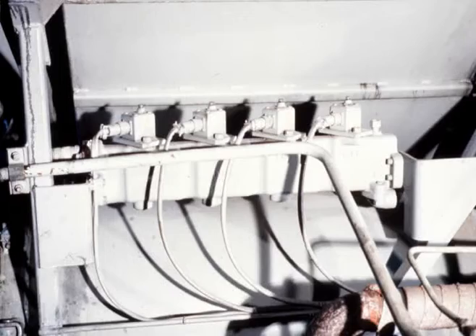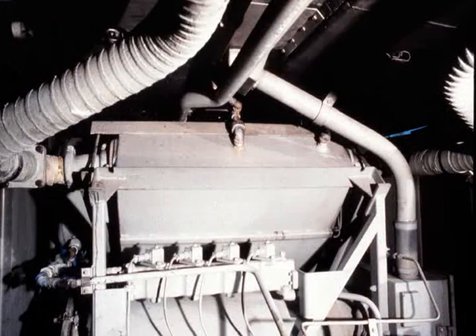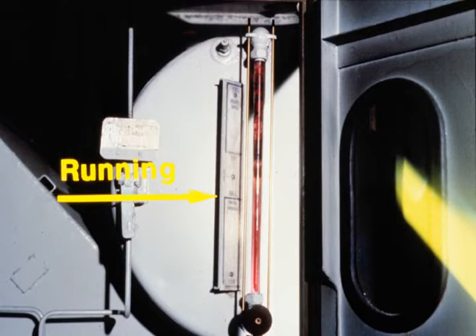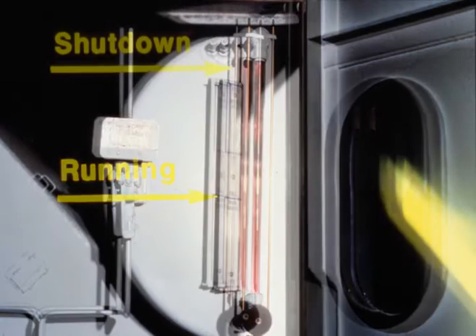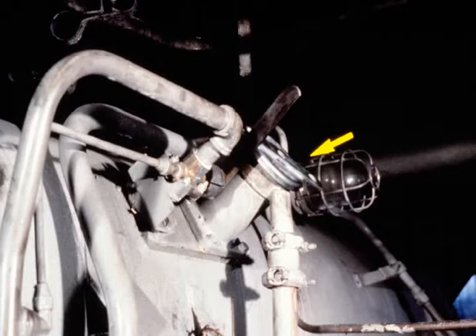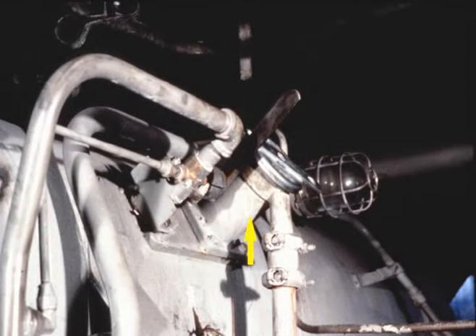Airflow and the exchange of heat is controlled by electric-powered cooling fans and a row of shutters on each side of the locomotive. The fans and shutters are controlled by temperature switches located on a manifold near the air compressor. Coolant flows through the radiators and back into the expansion tank and the oil cooler for recirculation. A sight glass on the water expansion tank displays the level of coolant when the engine is running and when shut down. Pressure inside the expansion tank is controlled by a 7 psi pressure cap mounted on a filler neck located on the side of the tank.